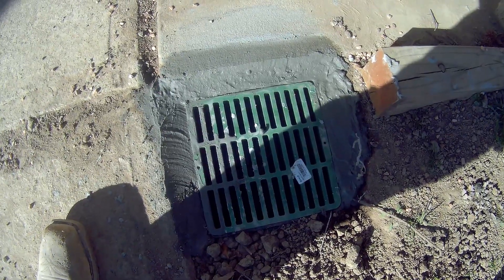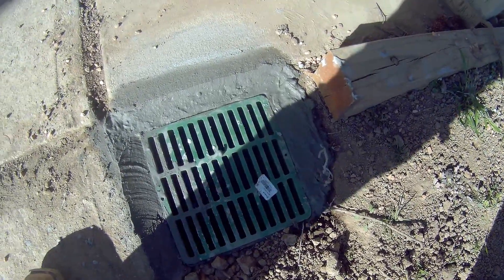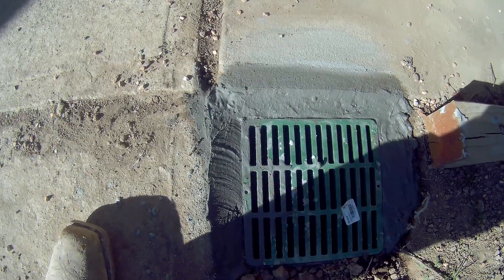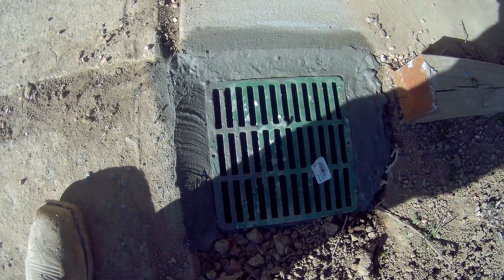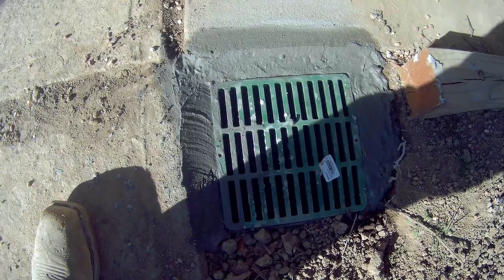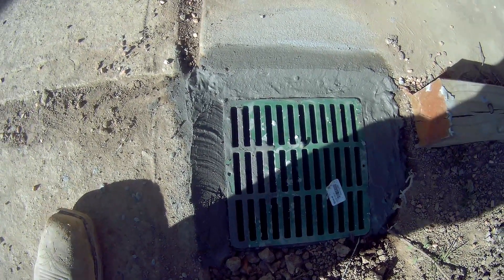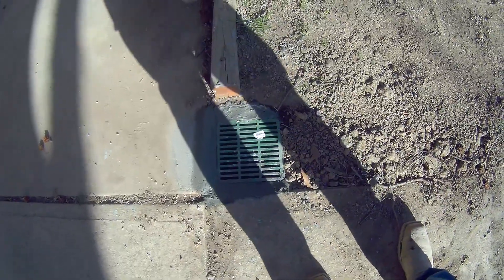There it is, all done. I took the liberty to go ahead and cement this in — I'm not saying this is the only way to do it, it's just the way I like to do it. Typically what happens around these sidewalks and driveways is when they poured, they got some overpour from their forms and you can't butt your catch basin all the way up. You can sit there and chisel it, but that's a pain, or you can tilt the catch basin trying to reach it — don't do that.